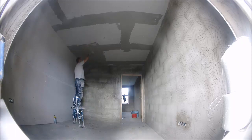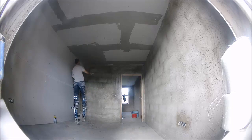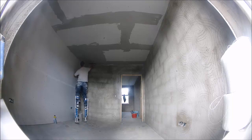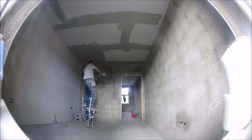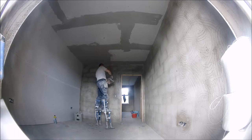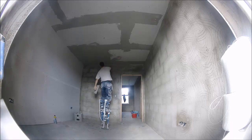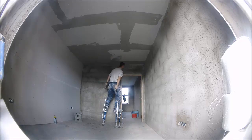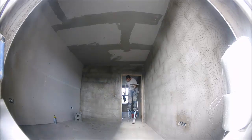The way I'd recommend is to try and get two even coats at about 1.5 millimetres each time. Don't worry if you have to go a wee bit heavier if the board is slightly twisted — in the corner here I've had to go quite heavy as one of the boards shot up. It might be a good idea to use a straight edge and check all your angles. You could bond out something if it was very badly off and have it straightened and ready to skim.